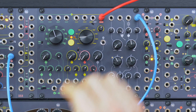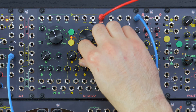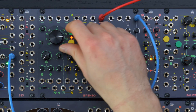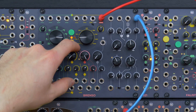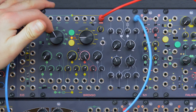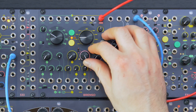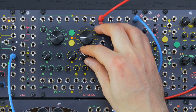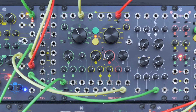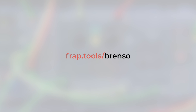You can hear the output of the wave folder as is, or you can further modulate it through a four-quadrant multiplier. A switch lets you choose between amplitude modulation and ring modulation. The main knob defines the balance between the modulated and unmodulated sounds, acting as a depth control, and you can CV control this parameter too. This combination of frequency, timbre, and amplitude is our idea of a complex oscillator — five colors that you can blend to create infinite shades.